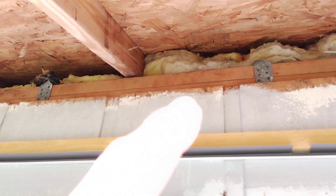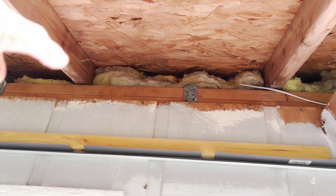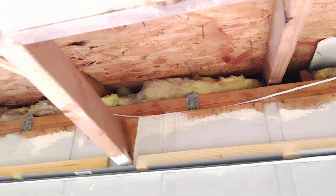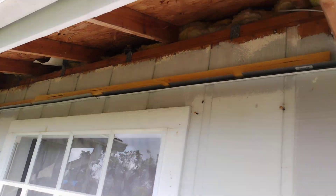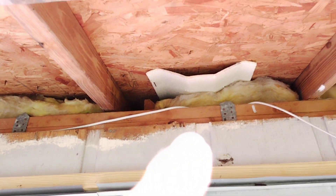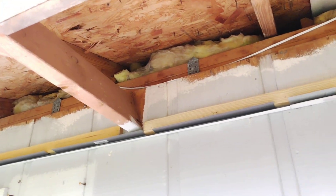The other thing you're going to want to pay attention to is your insulation. Once you blow out your soffits and the wind's been pounding on this for a couple hours, it'll actually push your insulation back into the attic or completely blow it through the attic. All of these pieces here were tucked back in there like two feet — a couple of them. I had to reach in there and pull them back out, and I got a little scratched up from the nails, so be careful doing that. I can see right here there's a piece missing, so I'm going to go cut a little piece of insulation to stuff in there. You want a little ventilation baffle in there — a few of these are missing. Keep an eye on your insulation because it'll be blown out of there too.